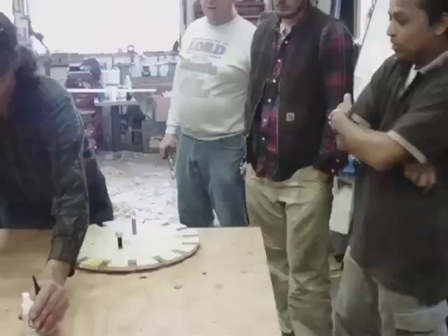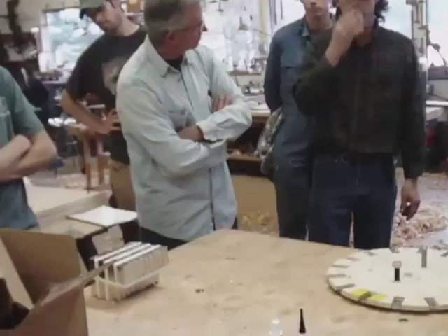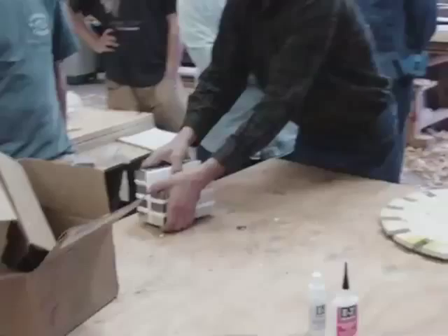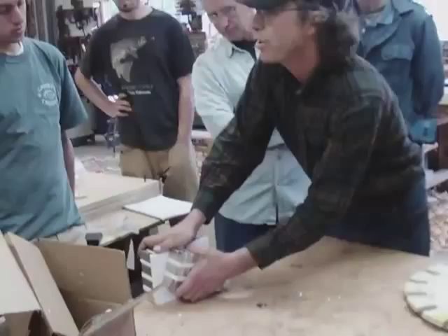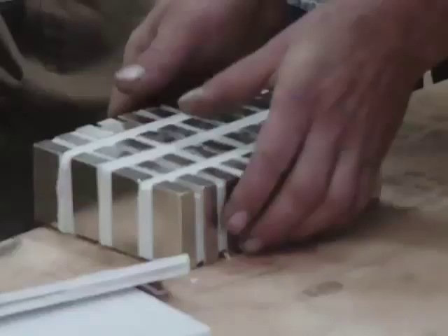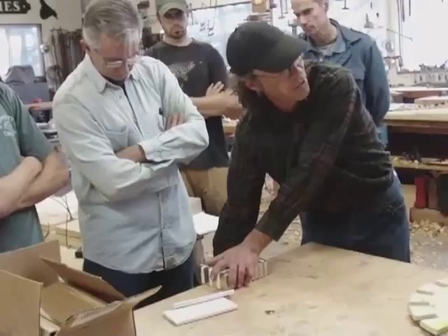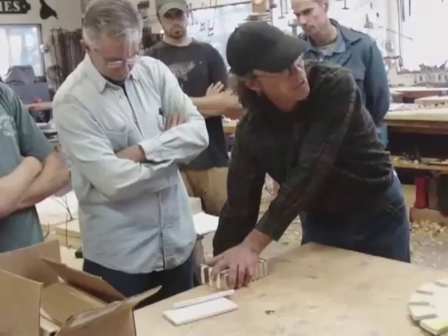These are the magnets, and I think we've all had a lesson already about how potentially dangerous they are. When you get your magnets in a stack like this, it's pretty easy to handle — just like individual magnets, you treat these like individual magnets. It's easiest first if you rotate them; you can only shear them apart, you can't pull them apart. I'm holding everything very firmly. The wooden work is meant to help get these apart. Get it right up to the edge and hold it very firmly. Once you get them apart, don't lose your focus — they can jump right out of your hands and they'd hurt you.